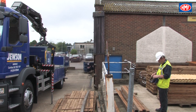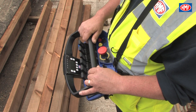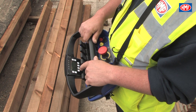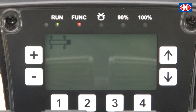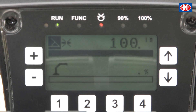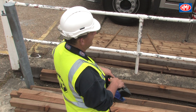At this point the crane is ready to be calibrated for crane mode. Press the yellow function button twice to switch the crane from stabiliser mode into crane mode. Now for the important part of calibrating the system: pull paddle lever 2, which is the main lift ram control, slightly towards you until a constant tone from the RCL can be heard and the F1 light is illuminated. Keep the lever in this position for a couple of seconds and release. A percentage light on the RCL and chest pack will indicate the level of calibration, accompanied by three beeps from the buzzer. The crane is now fully active and ready to use.